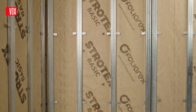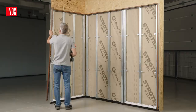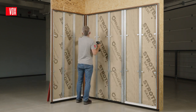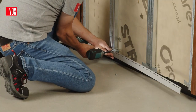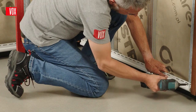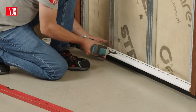For horizontal installation, the Fronto panels are fixed to vertically laid battens, or in this case, to metal substructures. The actual installation of the slats starts with the leveling and fitting of the vertical trims, followed by the installation of the lower ventilation trim and the SV11 starting trim between them. All the trims must be accurately leveled using a spirit level to ensure that the panels are installed correctly.